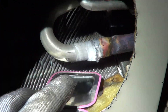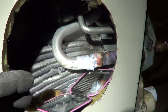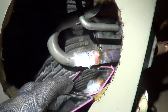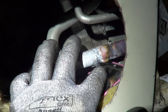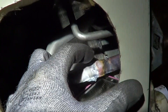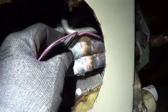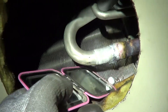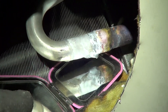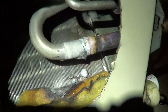Here's the joint — I did have to hit it two more times. The first time there were really large pinholes, the second time smaller. What I found is you've got to use such a tiny amount of heat, it's not even funny. It never leaked on the bottom because I never got good heat on the bottom, but I was having trouble on the top. It's almost like you don't think it's hot enough — then you're at the right amount of heat. You can see we've got good feathering on the joint. There's my blob because I wasted some solder, but that joint should last and be good to go.